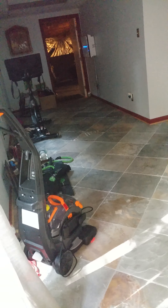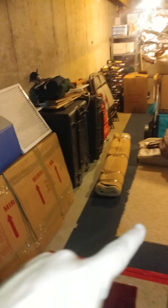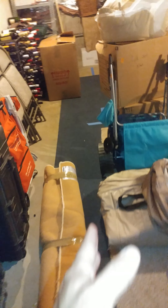They've got nice flooring in here, and so we're going to have to plastic off all this right through here — they'll tarp it off so we don't destroy the floors. They're newer, so we're good to go. And then in here there's the main stack. The main stack comes in and comes over this way. There's a Y for something, a floor drain and something else back there, and then there's another Y like right here for the bathroom that's right there.